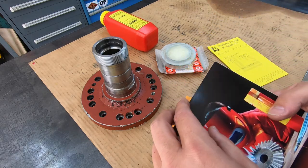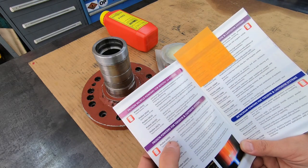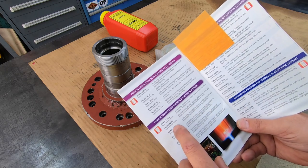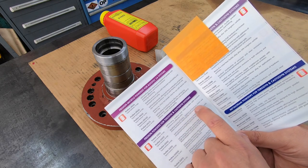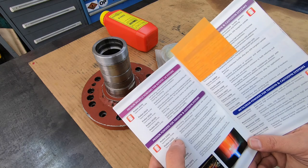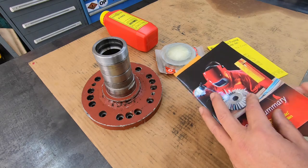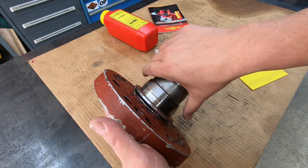And I don't normally show you the info on the powders, but if we go in here to the book, 21022 is very similar to 21021, and I'll tell you what it says. Self-bonding medium hard nickel powder with excellent resistance to adhesive wear. The one we're going to be using, 21022, is a modified version of 21021, with additions of chromium, boron, and silicon that increase the machinability and service temp. All right, that's one of the reasons why I like the 21022, which is what we're going to use. To me, it has a little bit better machinability than the one series above that. But it is a nickel-based powder, and it creates a very good surface for a captured bearing.